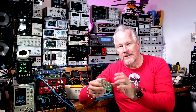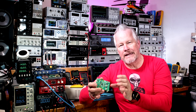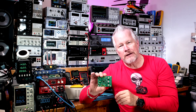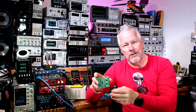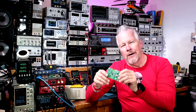The control chip does the magic here with the GaN FETs. The LTC7890 — it's an Analog Devices LT chip — can drive GaN FETs directly, which is awesome. Between that and the small GaN FETs, the circuit is very efficient, very low noise, and very small. The two-phase buck converter lowers noise, and the quick switching means less dead time is needed.